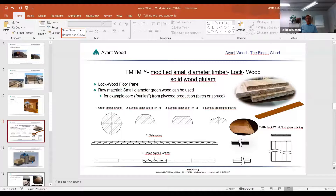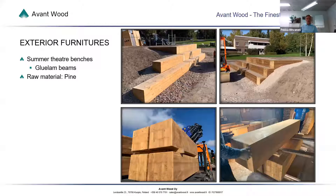You can select the process parameters as you want. For example, we see that we reduce the drying time — those would normally be something like 400 to 500 hours, and we did those in 50 hours. And we increased the strength properties, MOR and MOE, by about 30 to 50%. So Acacia, rubberwood — they earn a new life in the circular economy.